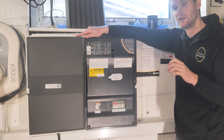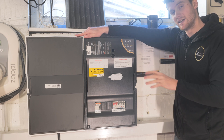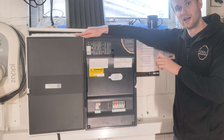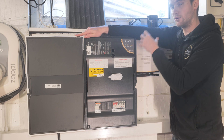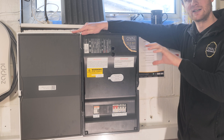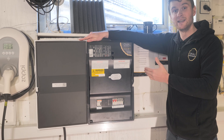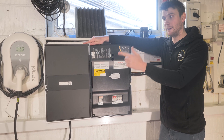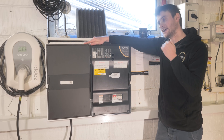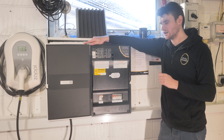Usually these systems only keep solar energized if the solar is physically wired through the battery. Tesla, like with the cars, are on a different level — they're able to keep the solar energized through the Tesla gateway, which means the 10 kilowatt hours in the battery during a power cut is prolonged because the solar might be kicking out two kilowatts, satisfying a lot of the daytime load. The battery power can last overnight, and it'll even charge up if there's surplus solar during a power cut.